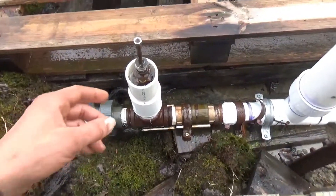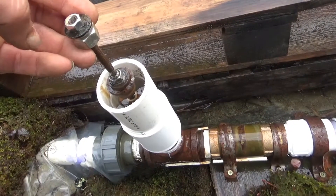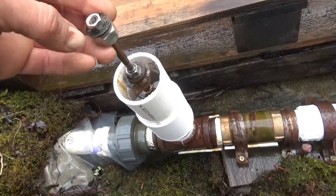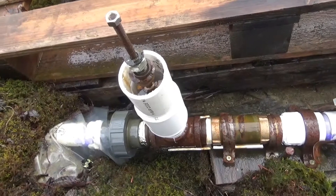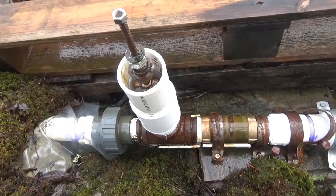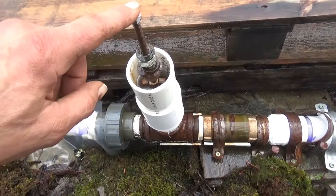The point of this video: I'm doing a weight test. I've added some weights — I was running just with the bottom weight set on, which has been very reliable and steady, producing about 0.88 gallons a minute at the test valve up top. I've added a few more weights and it seems to run steady and reliable still. I'm going to start it back up, go up top, and test whether the flow has increased or decreased. In theory, increasing the stroke should increase water delivery.